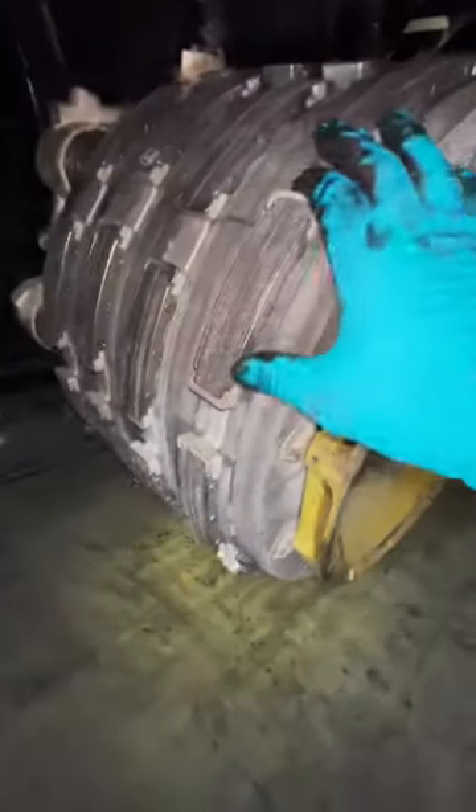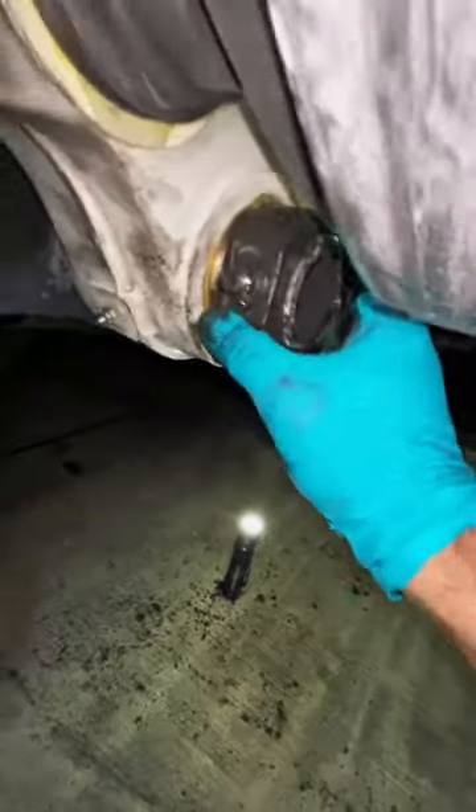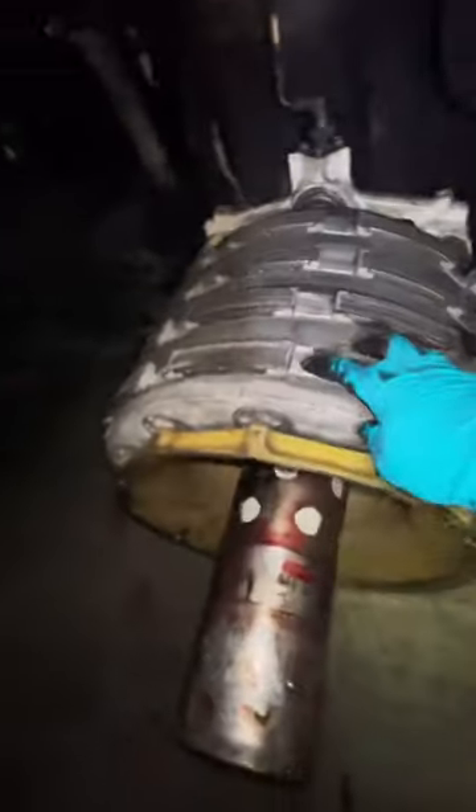In the same manner and using the same equipment, we will install a new brake as you can see here and reinstall the anti-rotation pin. Inspection will take a look at that and give us approval. We also install the hydraulic line, which is right there, and reinstall the brake temperature sensor on the other side of the brake.